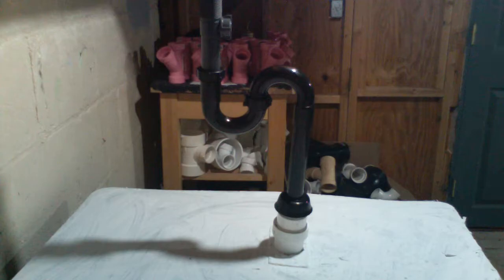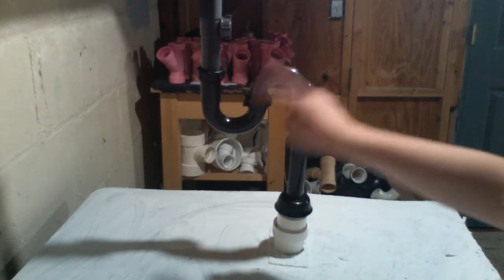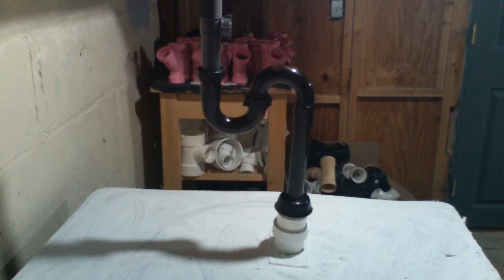The only time I recommend you install a new s-trap is if you're just renting the home and you need to make a quick fix. But if you have the time and the money, try to install a vent — it'll bring it up to code. Now to remove this old s-trap, there might be a little water but not much since it's going to be siphoned out, so just put a bucket under this j-bend.